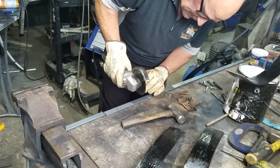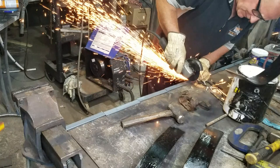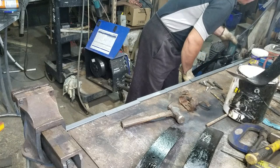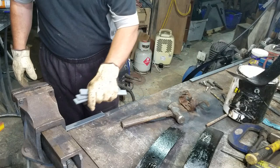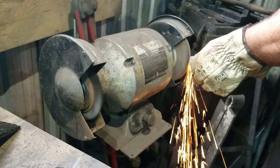The first job is to create four new wraps — the bars or straps that go around the pack and hold it all together. I've measured the length of the old rusty ones and I'm making new ones out of 5mm by 25mm flat bar. I'll drill a hole through the centre of each one after cleaning up the edges so they can't dig in while I'm working on them.